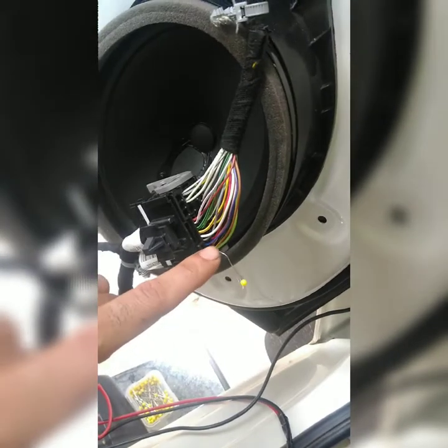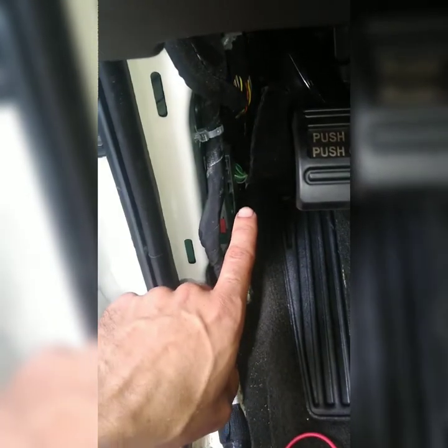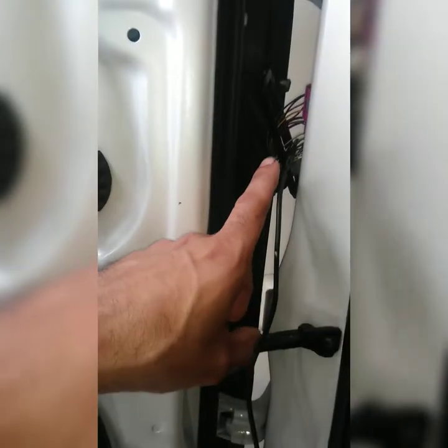I pinched the other one right there. With my meter I checked for continuity point to point — from here to here it was perfect, from here to here it wasn't perfect, open loop, then from here to there, perfect. So I have a problem in the section from here to here.